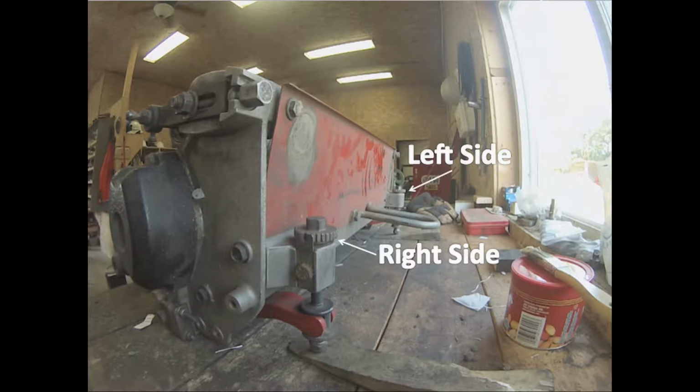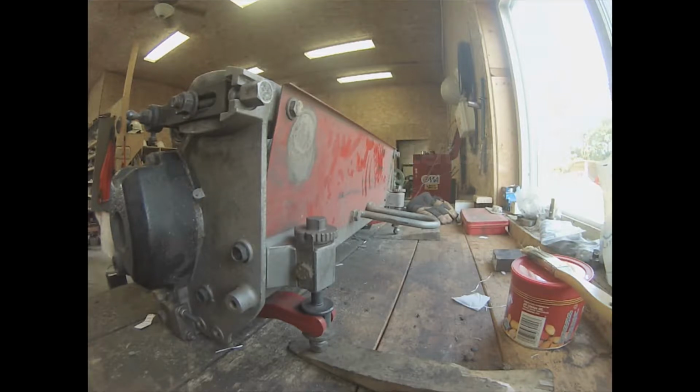And of course, if you loosen the nuts counterclockwise, it will lessen the amount of contact that you have with the bed knife. Now that the bed knife's just making contact with the reel's blades and is even all the way across the reel, we are ready for backlapping.